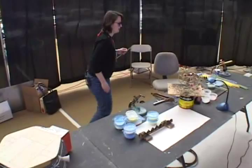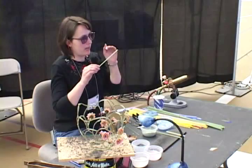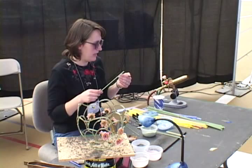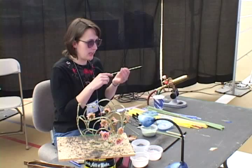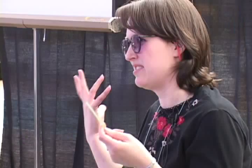I'm really careful. The way I was taught to determine annealing was you take your cane, and if it moves a quarter of an inch over an hour in the oven, then that's your slump temperature, and you subtract 40 from that. So I will take my colored cane, different lengths, put it in the oven, do careful tests, and recalibrate my oven every few months. But my part oven, I just think it needs to cool. Everything gets re-annealed or annealed a bunch of times.